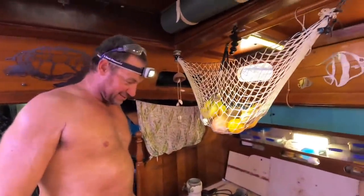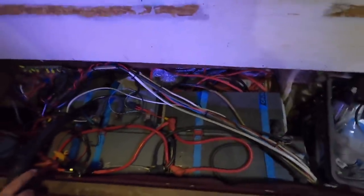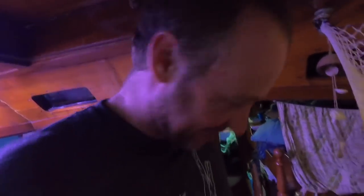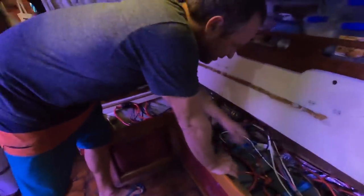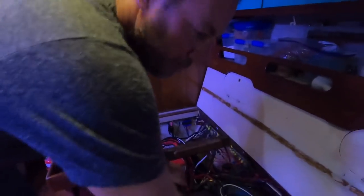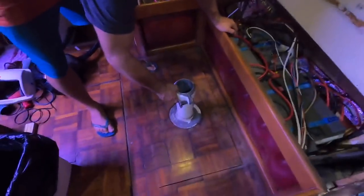I'm going to have a little break, clean up, and I'm going to have to go buy a vacuum cleaner. But we've got a good space — we think the batteries are going to work. This is our old battery bank: four 165 amp hour AGM batteries. Today was a success. I've cut a hole in the floor to make room for the new batteries, so all these ones will be gone. We're going to tidy up all these wires and make this another big food locker.